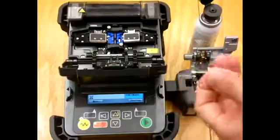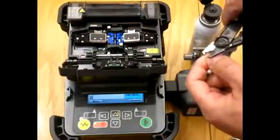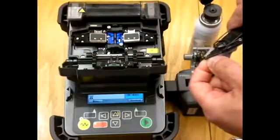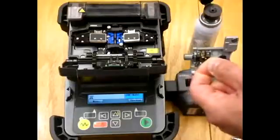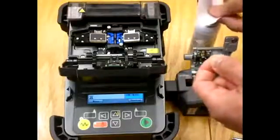The second step will be to strip the fiber. We'll be stripping the fiber approximately an inch and a half, an inch and a quarter long. You'll notice what Stephen is doing — he's angling the blade such that the fiber remains in a straight line. It's very important to do that so that the fiber is not micro-stressed.